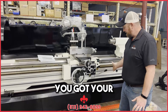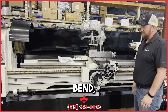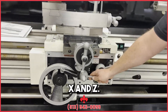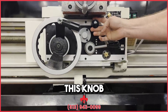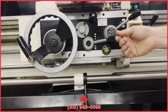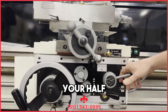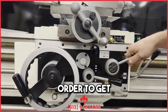Here's your apron. You've got your on and off lever — up for forward, down for reverse. Your half nut lever. Your feed lever for X and Z. There's a knob under here: you can see the Z is working with it engaged. Disengage that, push it all the way in, and now your X feed is active. With the X feed engaged, your half nut will not engage — you have to bring this knob to a neutral position in order to engage your half nut.